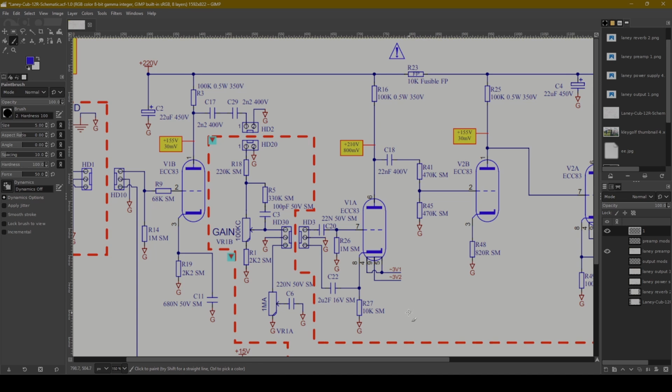Now, this would definitely also be a spot to consider some potential modifications. You could copy this or something similar to it, or like on a Fender amp, you could do a 1.5K and then put a cap on, bypassing it, like 25 microfarads, and you would get more gain. And by gain, I mean signal amplification, but you would get less clipping and less asymmetrical clipping. So you'd basically be changing the flavor of the distortion to be less of this British JCM 800 asymmetrical thing and more of the center biased Fender thing. I might experiment with this.